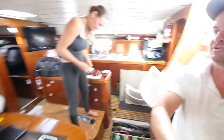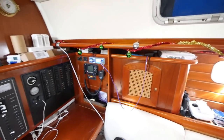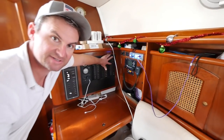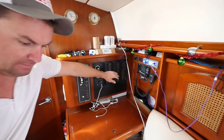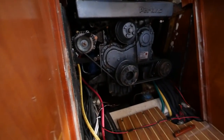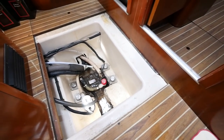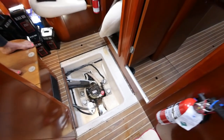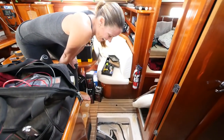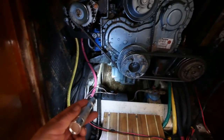Let's give it a shot. Turn it on — hit the button. I haven't changed the label yet, but it's this one right here — it says spare, I'll change that to say aft bilge pump. Turn it on. And I hear it running — it's running down in there. We got activity! We got water coming in here. That other flow pump is on too — it's double pumping. The automatic function has shut off on the bilge and you can see all that bilge water is gone. It's kind of nice.